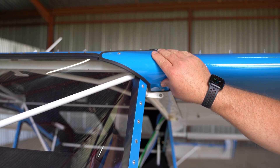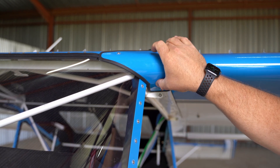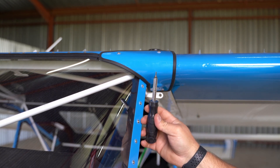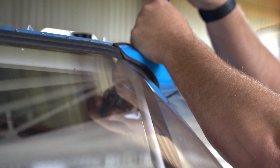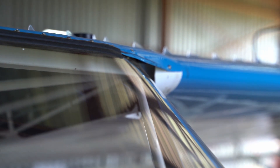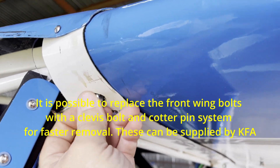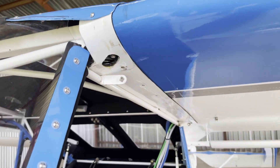Step two is to remove the cuff, which covers the position of the main bolt — you're going to remove this bolt in order to fold the wing. To remove the cuff you need a 2.5 millimeter allen wrench. After removing the cuff, the bolt is an M8 requiring a 13 millimeter wrench. We're going to remove the nut of this bolt and then leave the bolt in place and move to step four — we'll come back to this bolt later. Once the nut is removed, the bolt will be pushed out once we're ready to fold.